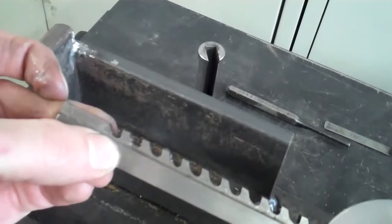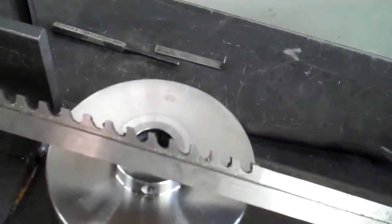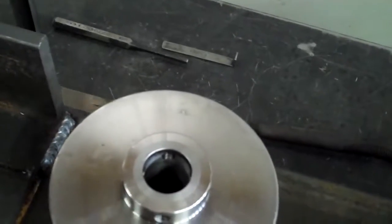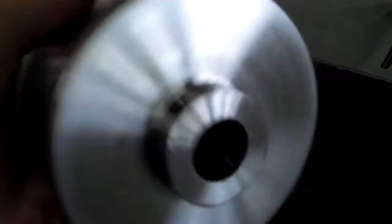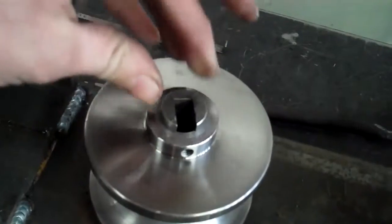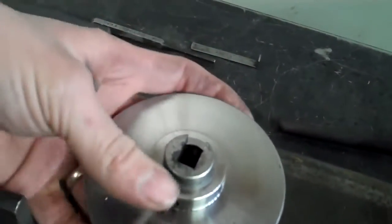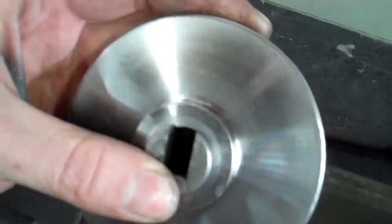You can see the distance is relatively minor, and it progressively gets bigger. Eventually it will carve a rectangle path in the center of these roller dies that I sell. From this point forward, broaching the dies will be something I do across the board for every die set. I'll be getting rid of one of these set screw holes and adding the internal keyway.